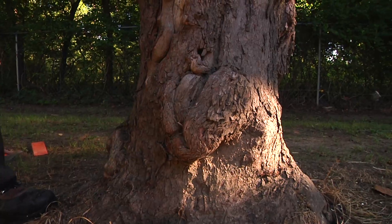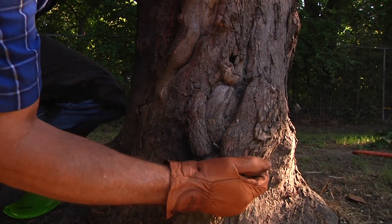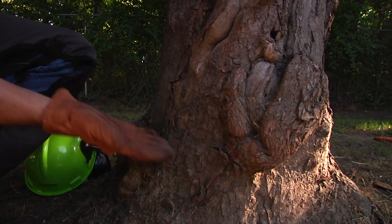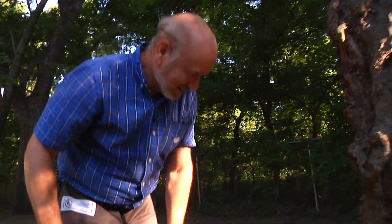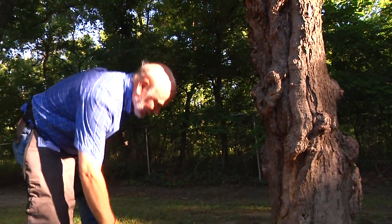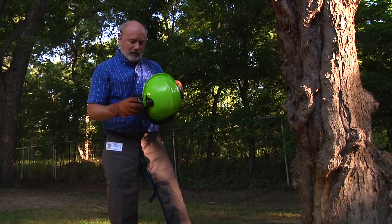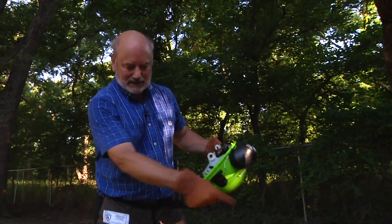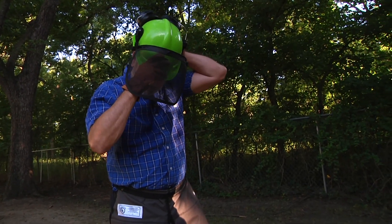Look at our first cut here — we want to make a wedge right here. There's a big burl right here that I'm going to kind of lose, maybe not if I make my cut right. I want to make a 70-degree pie cut coming down like this, and then a cut across like this that might pop out — we might be able to save that piece of wood. Kevin lied to me, he said 12 inches; this is a 14-inch bar and I think the tree is a little bigger than that. I would have brought my bigger chainsaw. Also, if you do have a second chainsaw, make sure you bring it — if you get that stuck in the tree, you need another chainsaw to relieve that cut.